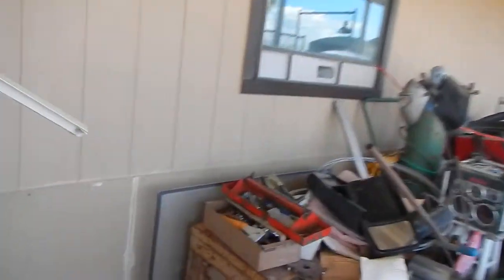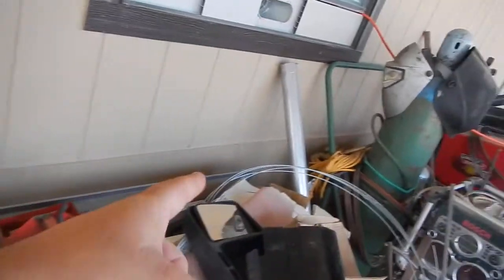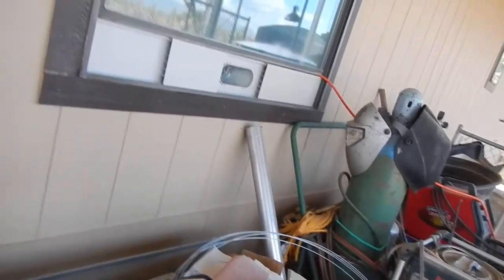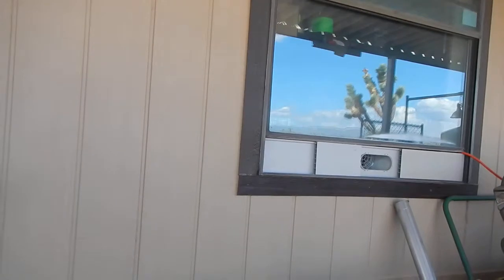I'm replacing it because I don't like electric stoves, and it's going to change to propane, which the rest of the house is already running on, so that'll free up that service. Somewhere in here, I'm going to cut into the conduit that's there and pipe that into the room — that'll give me 60 amps there, and the 60 amps I bring in from the pole will give me 120.